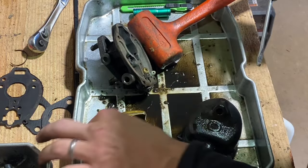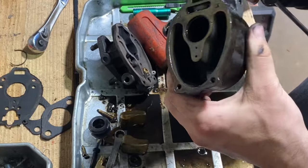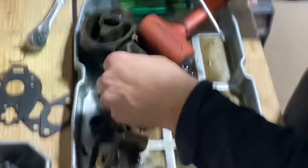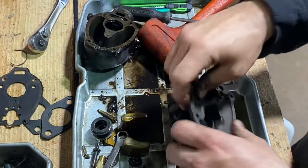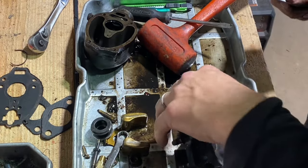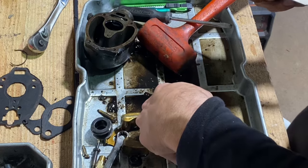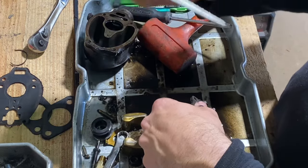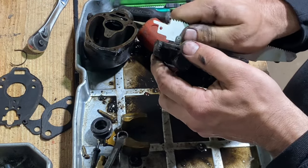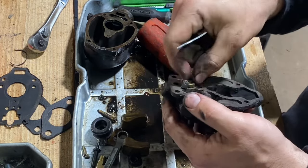So we'll plug. Yep. All right, so that's everything we can take off of here. So this side, go ahead and pull this seat where the needle goes. I like to use the bottom side of a reciprocating saw blade because it fits in here nicely. Get some leverage on it and it pops off real easy. Just be careful not to cut yourself. Be smart.